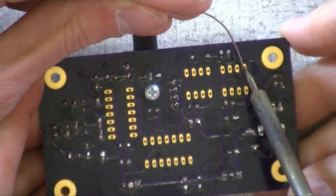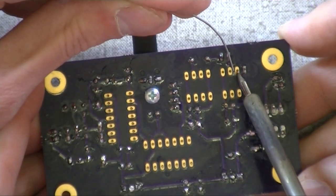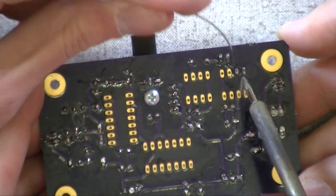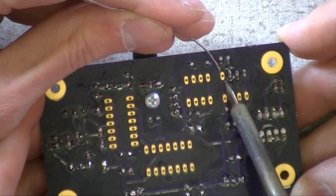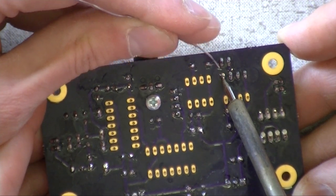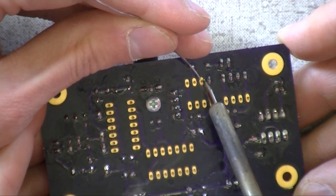Okay, now. Small iron on these. Small iron, speed soldering. You don't want to melt the socket. You don't want the solder to flow up into the socket, although I'm using sealed bottom sockets to minimize that. Early on, we bought cheap sockets that had open bottoms. If you got a little over rambunctious on soldering, the solder would wick up the pin and into the socket and fill the hole of the socket so you couldn't get the chip in. That would be bad.